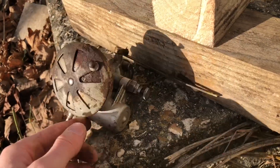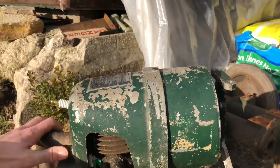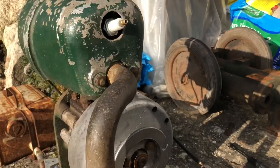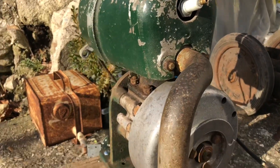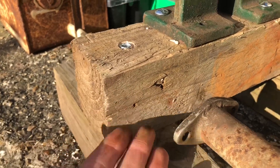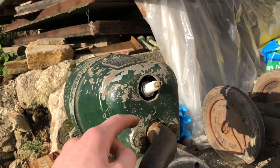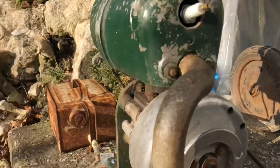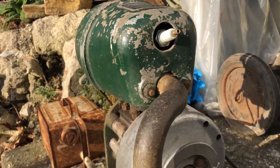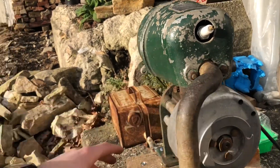The other problem we've found with the engine — nothing major — is the exhaust pipe. The way it's been formed and comes out, it would have fitted nicely in the generator base, but for testing purposes it's coming out and sitting just there, which is going to be quite noisy. I'm planning on cutting it off at the manifold where it bolts in and welding it so it comes out to the side at an angle. I might also swap the ends over to get a larger piece coming out to the side.